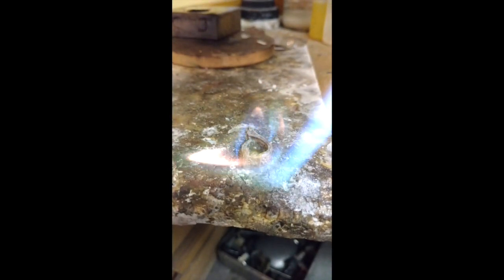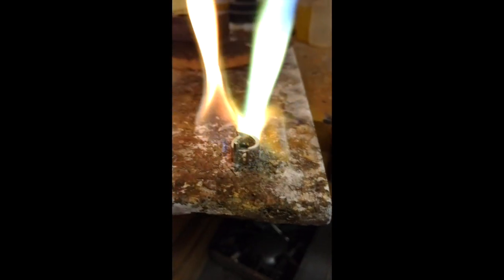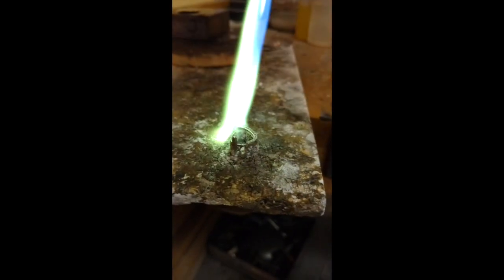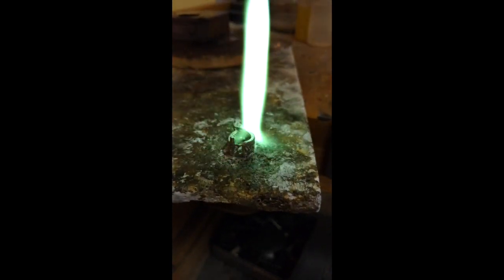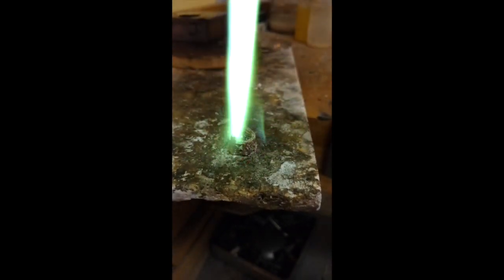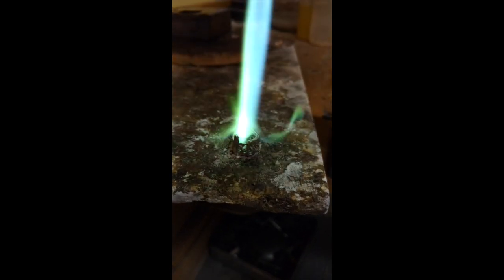Here's the video — just take a look at how long I'm actually heating the metal up and when I pull the flame away and let it air cool. In preparation for the annealing I dipped this into isopropyl alcohol — 90% isopropyl — and boric acid. That's the fire coating that will protect it from getting fire scale or anything like that.